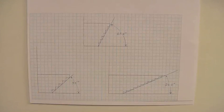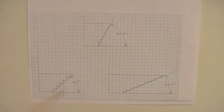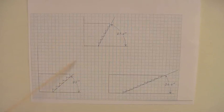The people that are having trouble have failed to realize one thing, which I did not say in the video. I used a 45 degree angle, so I went up a quarter and out a quarter. I cut that back down to 0.210. But if the bowl would have been very tall, I couldn't have got away with that for very long.